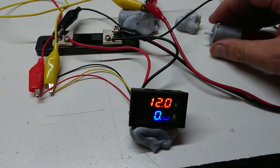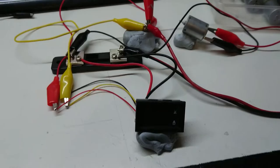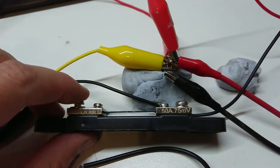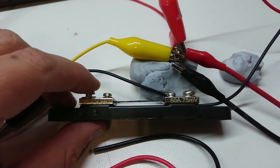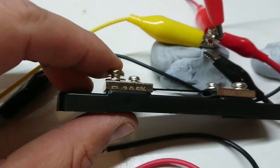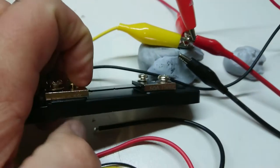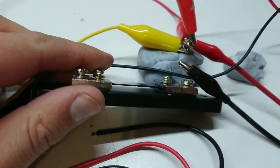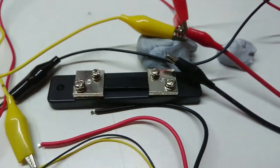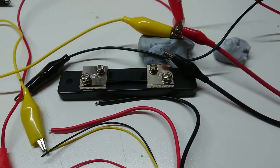I've only got a five amp fuse on this circuit, so the lights may dim when I wind this in. That's good. Now I need to shut this down and clean all the blue tack off the shaft. I'm examining the shunt here and it says 50 amp, 75 millivolts on the side. I suspect the existing shunt I have is also a 75 millivolt one, so I'm going to crawl through the cabling area under my desk — which I warn you is kind of messy.